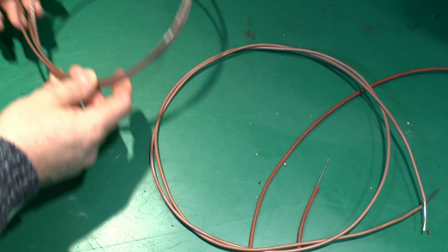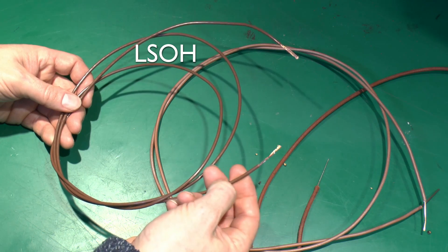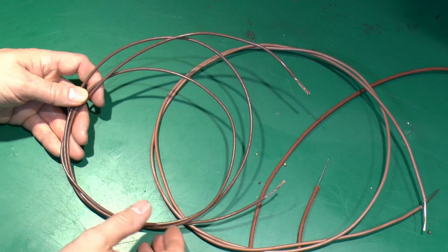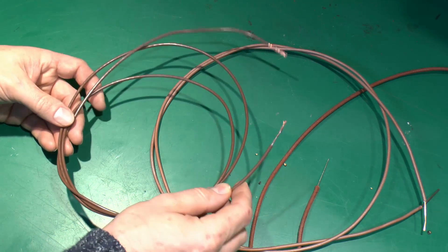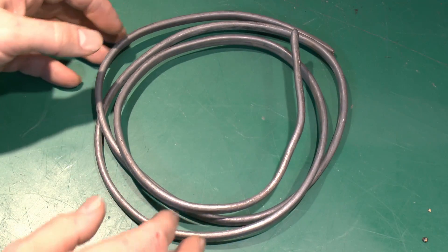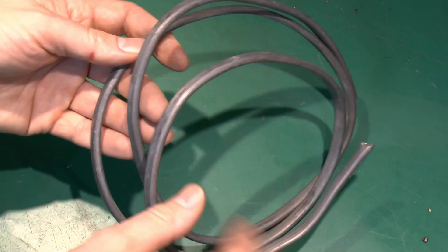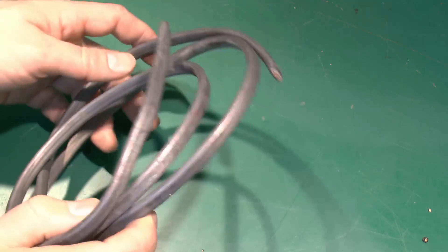The third item is this one — again plastic insulation, but this is the low smoke and halogen-free variety. When it heats up and burns, it should not give off vast amounts of toxic smoke, though of course there'll probably be some — it's low smoke, not zero smoke. This is a stranded core but still solid copper pieces, just more of them, and a similar dimension to the other cables. We're going to test all three individually outside, as we don't want to be breathing in the toxic gases. Also sent in with that rubber cable is this lead-covered cable — all of the grey material here is actually lead rather than plastic, and it remains in shape very easily. We won't look at this today, but we'll have a look at it at a later time.